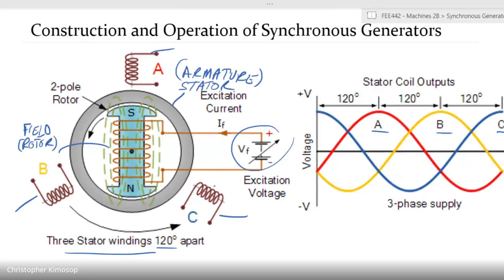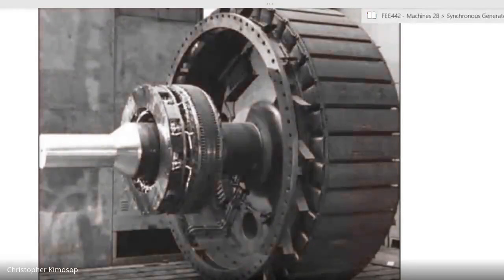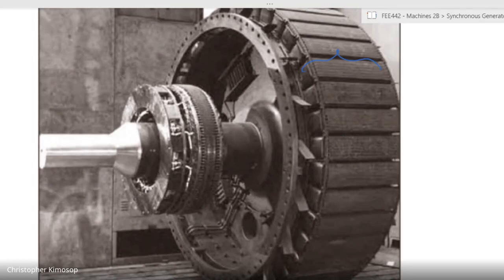So just to do another demonstration of that, you would find that generally the windings have a short cylindrical base, and you would have salient poles. That is, they are not a cylindrical rotor, it is salient poles. Each of these represents a pole that is providing magnetic field to the machine, right?